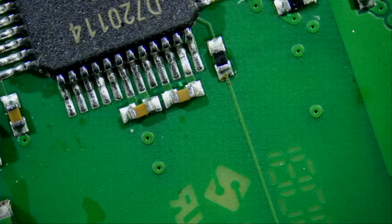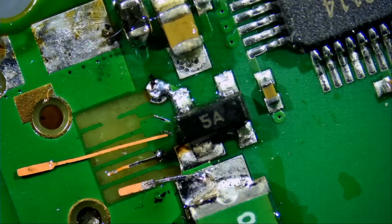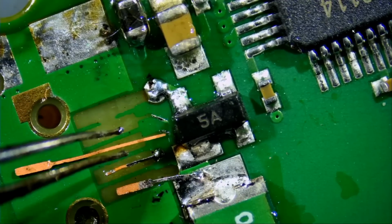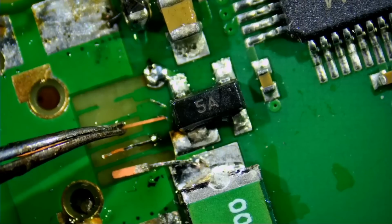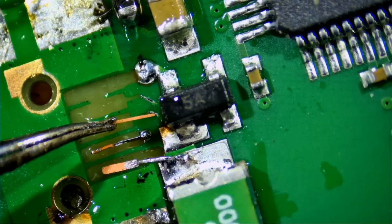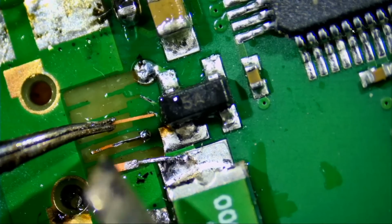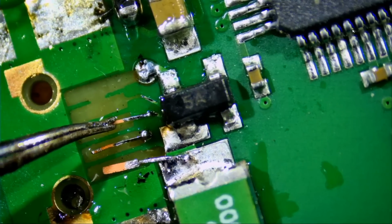And that's the thing about tweezers. It does not matter how much money you spend on a tweezer. If it falls once on the floor, it's over. You can fix it, but it will never go back to being the same again. What we do is we end up grinding the bent tip a bit so we can make it straight again. The grinding stone does a pretty good job. I have a video using the grinding stone. You can look at it. And this one is perfect. Very nice.